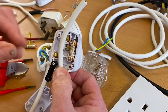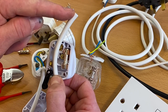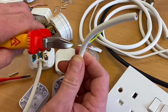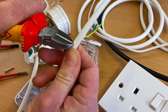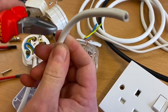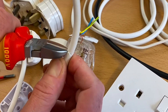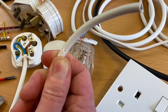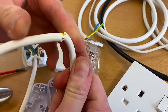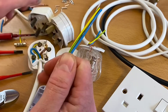We're going to bring it into position, longer than we need it to be. I'm just going to nibble round and expose the conductors, attempting to lay them in as neatly as I can — it is a challenge. So using side cutters this time rather than a knife, I'm just going to nibble just a little bit — not very deep — nibbling that outer PVC all the way round. Then use the same folding technique to burst it through, but obviously we don't want to have nibbled into the conductors. We take off this mechanical protection — it can be white or black.